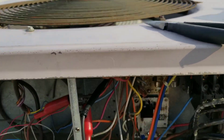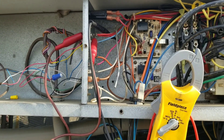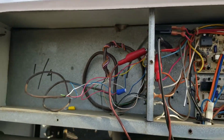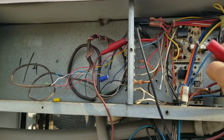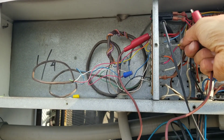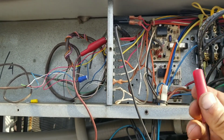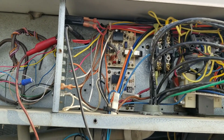What I've done so far is remove the yellow wire for my stage 2 cooling and bypass the thermostat on stage 1, and I did that without any issue. So now I'm going to jumper to the stage 2 wire and see what kind of results we get. Chances are our little popper will pop, and if that's the case then I'm somewhat certain our issue is in our stage 2 cooling.